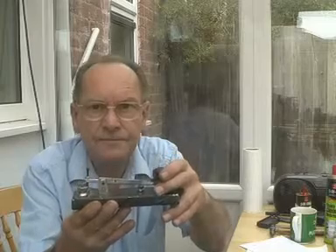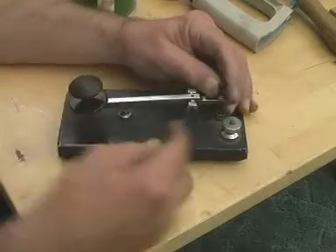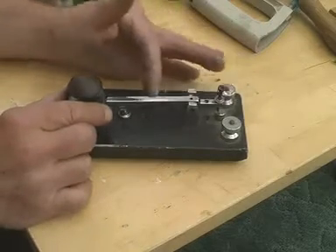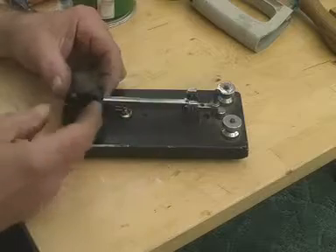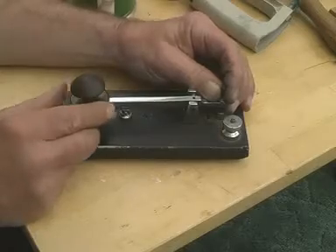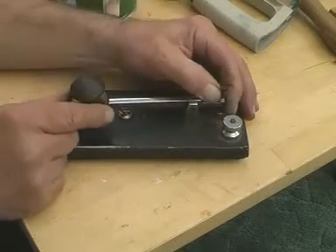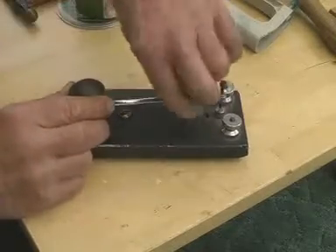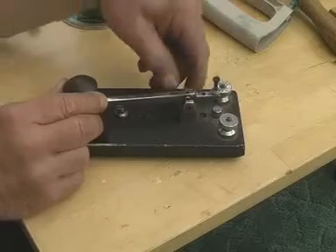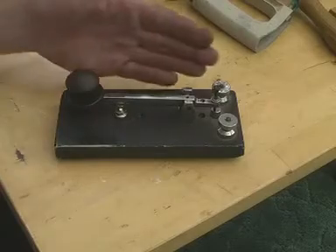So we'll take a closer look at it. Here it is, and the first thing that strikes one about it is the shortness — the shortness behind the pivot to the backstop, which is one inch. Then the length of the arm in front of the pivot, which is four inches, so it's a five-inch-long arm with a very offset pivot. I always liked it very much. The front stop was originally here, so I moved it there and liked it even more. The only issue is the pivot — the thread is stripped that holds the arm to the shaft, so it's really worn out.